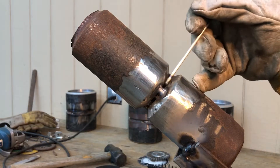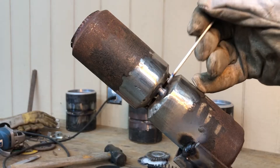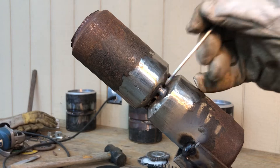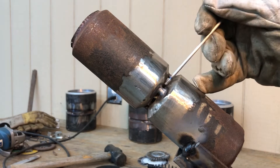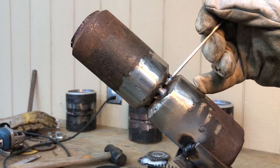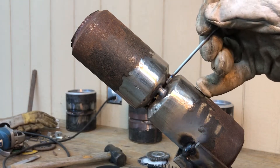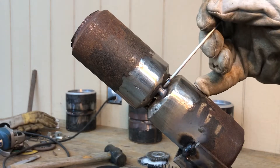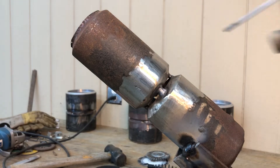So here's the deal — this is the easiest way to learn. A lot of people will say your gap has to be wide enough to fit your wire inside. If you get it that big when you're trying to learn, well then you have nothing to rest your wire on really. It's just sitting there in an open gap. This way, it's just small enough that it will hold your wire. It won't let it through. Just lay that wire on there and as it melts, just feed just a little bit as it goes. That makes it a lot easier and it's really fast.